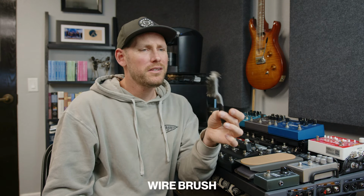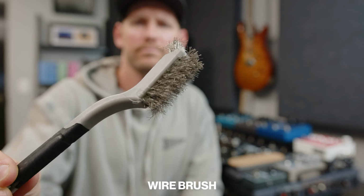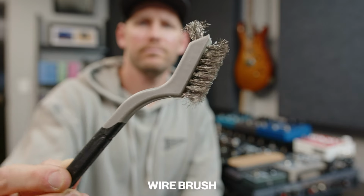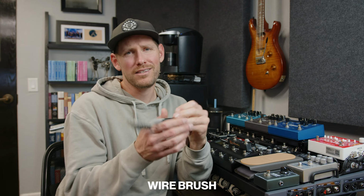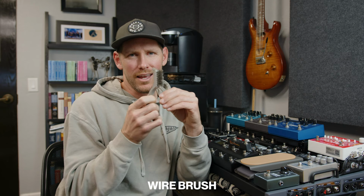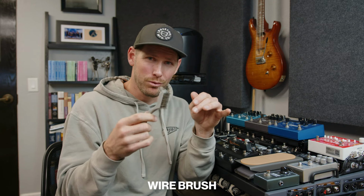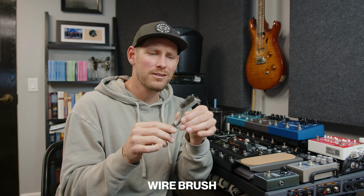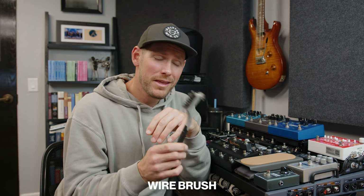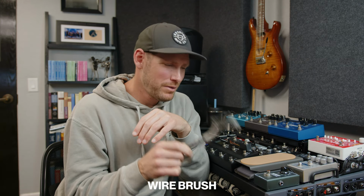This wire brush, you're like, this is not a solder tool. Well, no, it's not, but for the BTPA cable, and again, I'm going to show this to you in the next video on how to solder it up, this comes in handy. Because of a braided cable, you need a way to thin out and get that braid out. There's two simultaneous methods for that. One is the next tool I'll show you, and the other one you can get it out with this brush. So I really recommend this if you're using that BTPA cable.